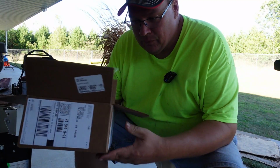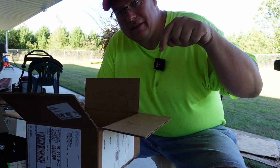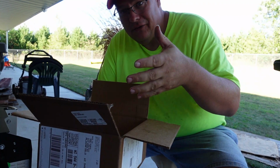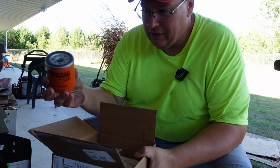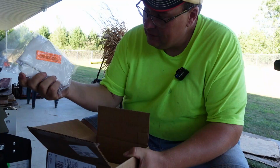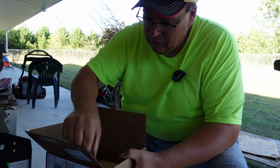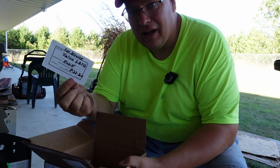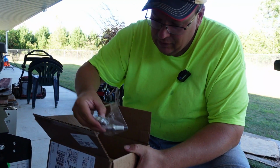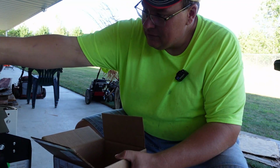Now I forgot to mention, you can order a service kit here right from Generac, or you can find them online. I'll put a link in the description below this video to one of these service kits. It'll give you everything you need to service your generator for about $20 or so. You're going to get a new oil filter, some instructions, there's a little cloth in here for cleaning up, little paper funnel, there's a sticker in here you can write your hours on and everything. When we're done, we're going to stick that right to the generator here. New spark plugs and an air filter. So we're going to do the air filter next.